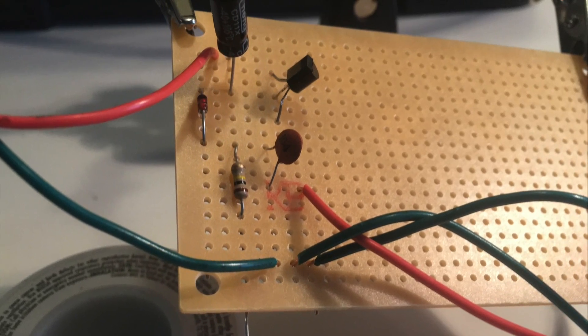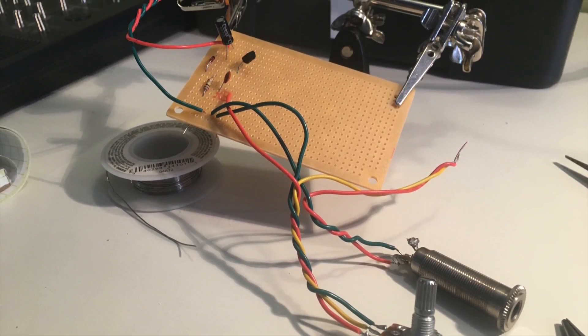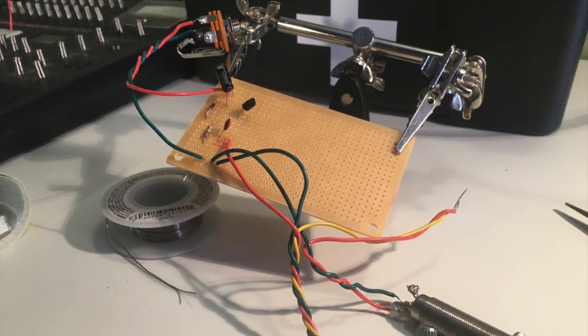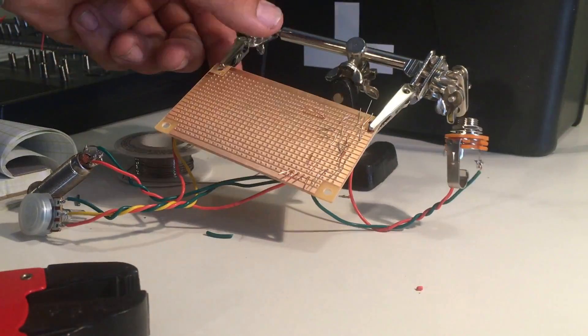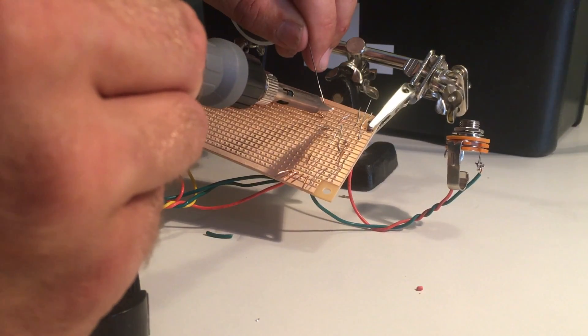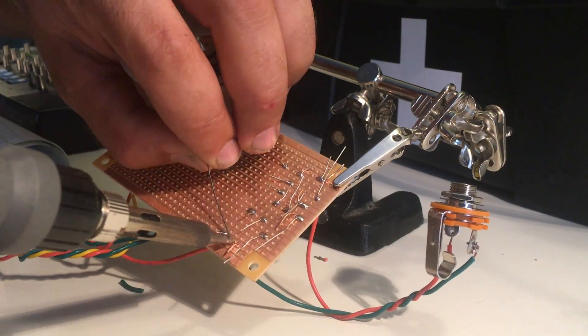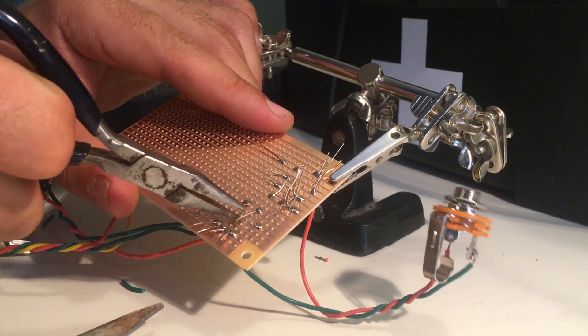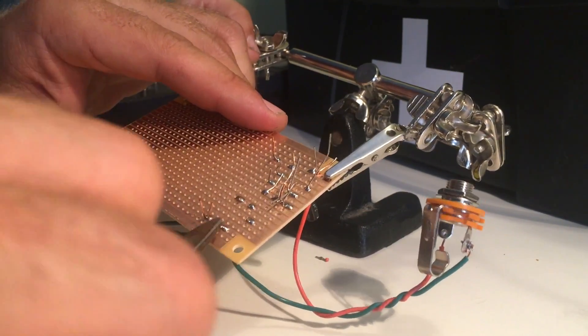There they are — a ceramic disc capacitor, an electrolytic capacitor, the diode, the resistor, the transistor, a couple jacks, and the potentiometer. Here are all your wires coming out the bottom of the strip board. Just solder each wire where it needs to go, make sure you get all your solder joints on every wire, then lift them up with some pliers and cut all the leads off. The strip board connects all the points together across its rows.